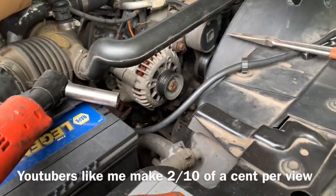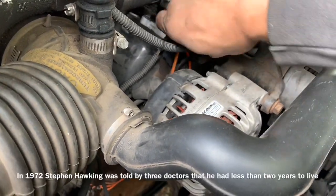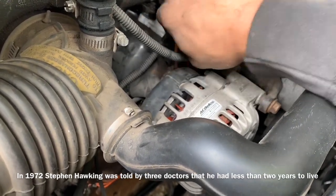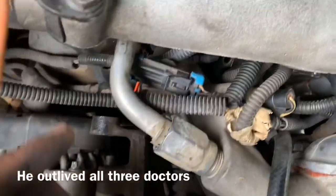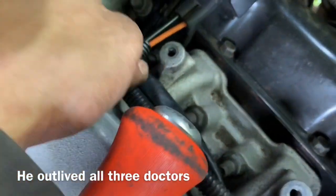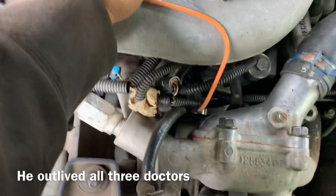These are very often misdiagnosed as having a bad pump. I'm not certain if this pump is defective, but I'm going to pull this air line from the back of my alternator, remembering how it's routed down through the bottom there, and we're going to pull a vacuum test. Be gentle with the line — we don't want to break it when it's not already broken. If you do end up breaking it, it runs from this location up underneath, back around the side, and goes in right here — it's probably pretty easy to replace. We'll replace this one with some new vacuum line just to make sure, because it's actually broken.